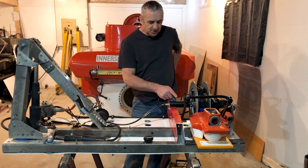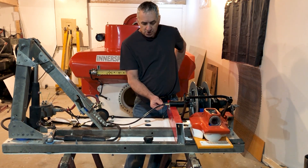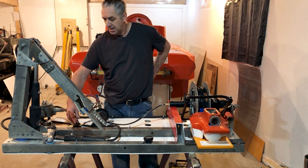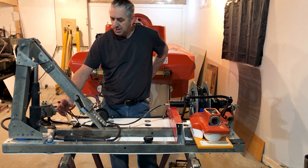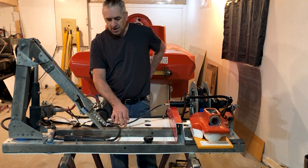The slip ring is inside this housing. The wires travel through this clear hose, which is oil filled, to this junction box that I made — it's just a void with a cap with an o-ring seal. And then this is the compensating hose, filled with synthetic oil, just some oil I had laying around.